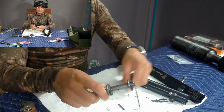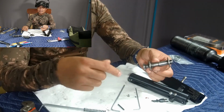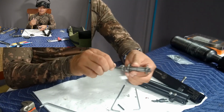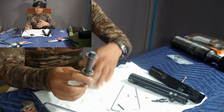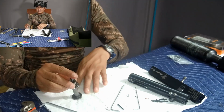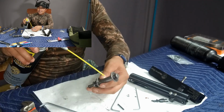Obviously the very first time you're going to have some problems because it's tight. The bolt is specially threaded for this sort of adjustment, so that the vibration doesn't make it loose. The thread is specially designed so that it doesn't vibrate loose and adjust itself upon the many impacts or vibration caused by this. But you want to make sure you lube this guy some when you're putting it back.